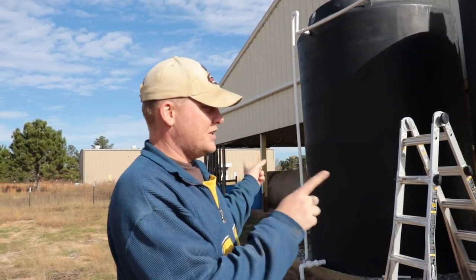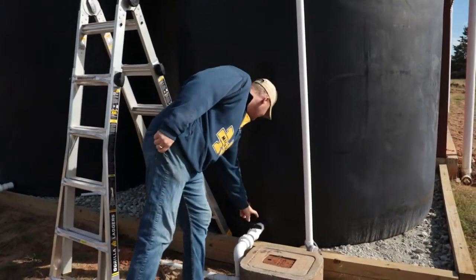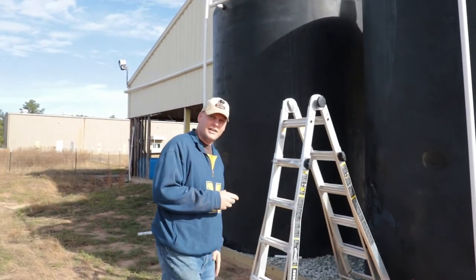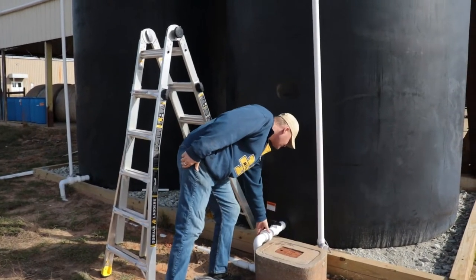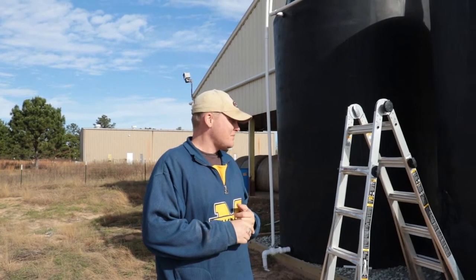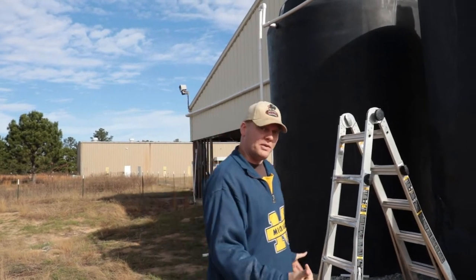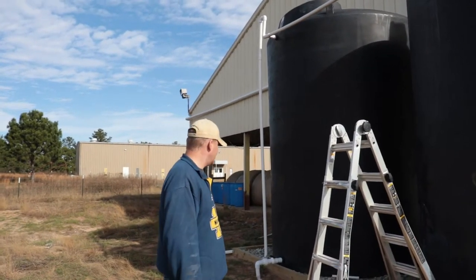So the reason I checked both was we shut off the valves at the bottom, down here and down there, because the last time I was here, the coupling on the far side started drip, drip, drip. That threaded coupling. So I just closed them off just in case. Now it got down below freezing, I think it was 26 degrees one day this week, and I was worried that I hadn't covered up any of these pipes, but these seem fine. At least I haven't opened them back up. So they were filling separately, individually. I don't think we have any cracking, but.